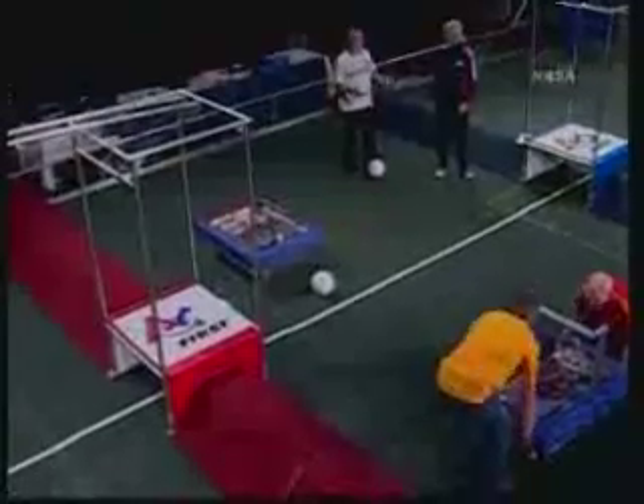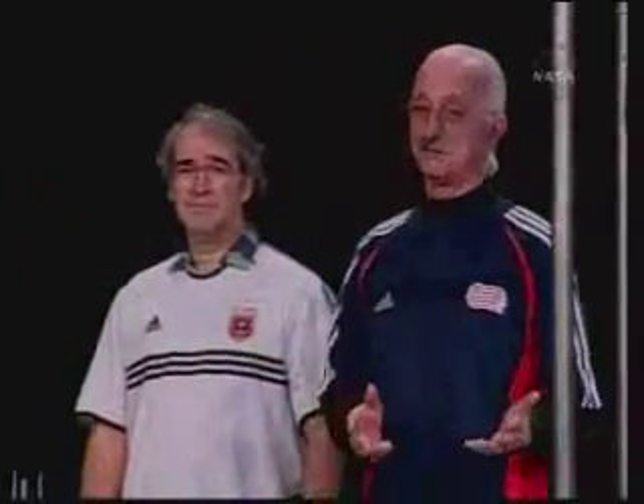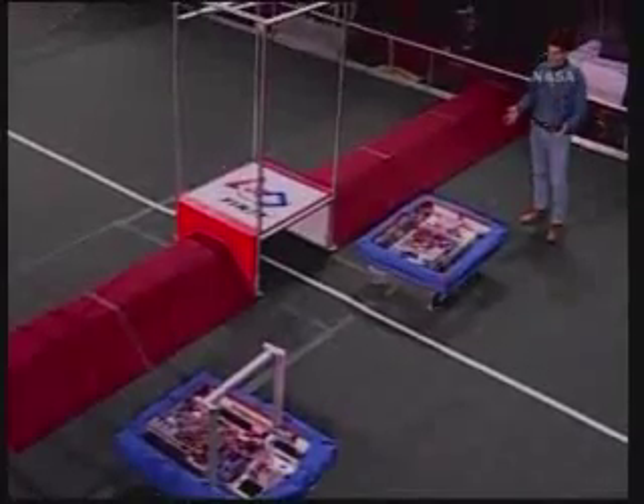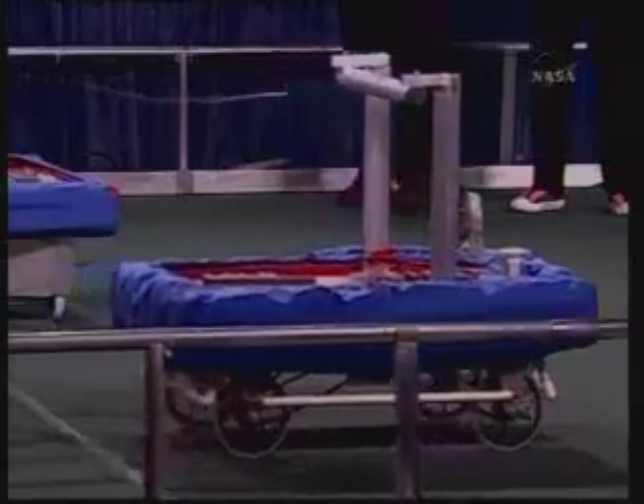Okay, let's get a look at these robots. Hey, isn't that a new gate? Yeah, it's there because we never want to see anybody carrying a robot over bumps — in fact, isn't that prohibited? Yes, it is, too dangerous. The first offense gets you a yellow card, the second a red card. So these are both legal robots: both within the weight limit, both within the size limit, and both built from the new upgraded kit of parts. We put four sticky wheels on this one — it climbs great, but the steering is kind of jerky. This setup may be pretty tough to aim using the vision algorithm in autonomous, and it might even be hard to aim in tele-op.